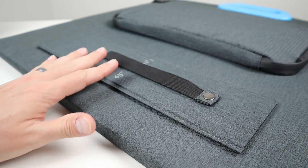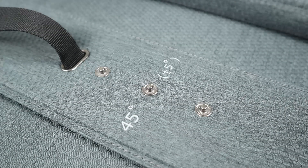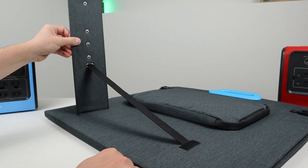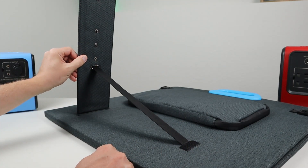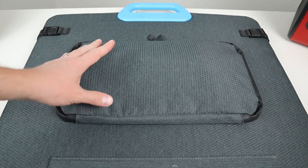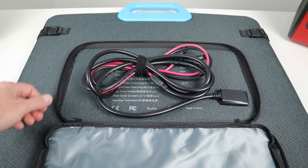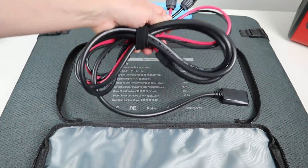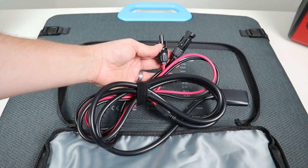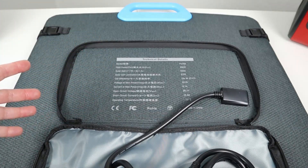I've always wanted a portable solar panel with adjustable kickstands, and Bluetti has an awesome design here. There are three kickstands with three levels of adjustment — there's a 45 degree mark you snap into, and two other adjustment options on either side. This lets you point the solar panel at the best angle toward the sun to get the most power into your battery. In the back is a padded pocket with two zippers. Inside, the power cable is 12 gauge wire — super heavy duty, about 10 feet long — and it comes with MC4 connections, so if your power station accepts MC4 this will work great.